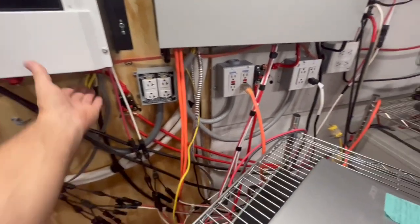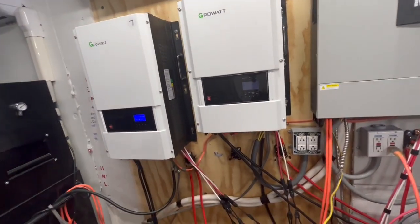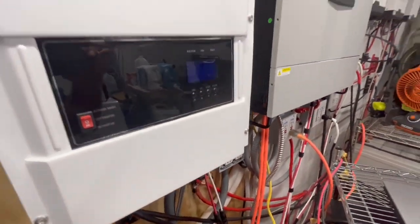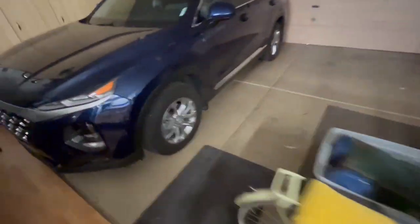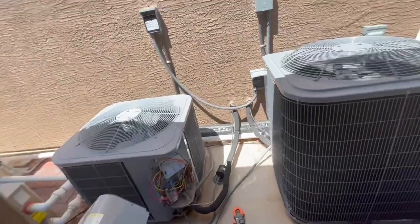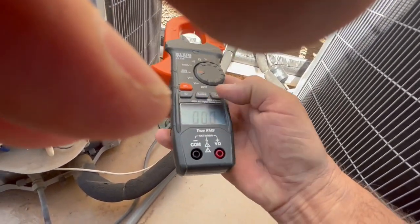We can go check our inrush current on our 6 kilowatt inverter as soon as this breaker resets. We can go out there right now and reset that. So yeah, I was just using too much. We'll have to go and wire that back up to either the 12 kilowatt or to the 5,000 watt MPP, because that ran fine off of that. So let's put this back on here and hit max and put that on for the inrush.